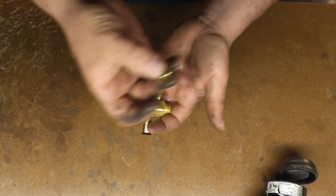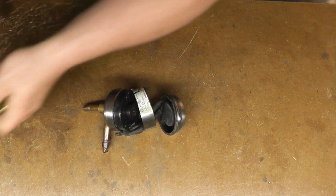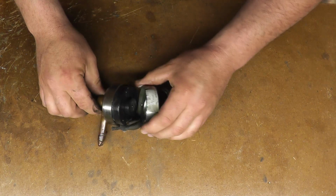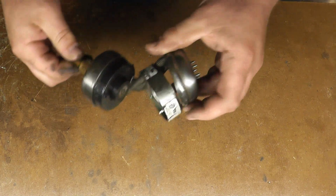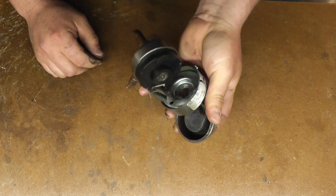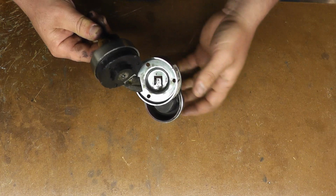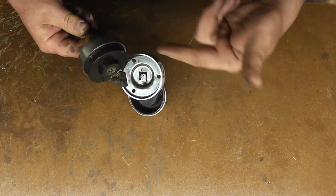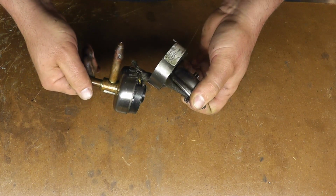You clean it up, and at least you can get it running. This, you're kind of SOL. This dies, you're kind of screwed. And like I said, if you have a Beacon 1 system that's not compatible with the Beacon 2 parts, and also nobody sells these things off the shelf. Nobody. The only parts off the shelf that I can get for those systems is the thermistor things, which is just this little sensing bulb, but no supply house is going to carry this. It's all special order garbage.